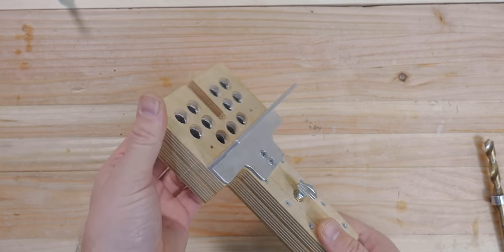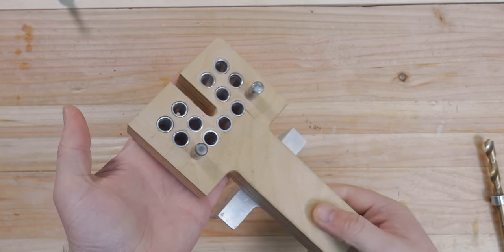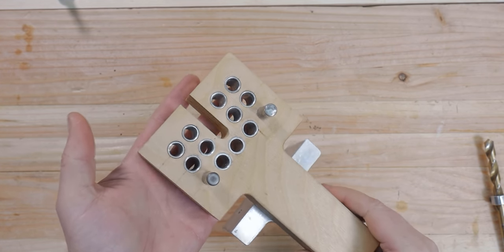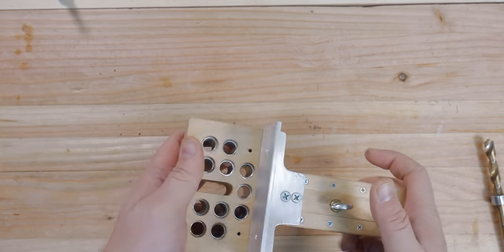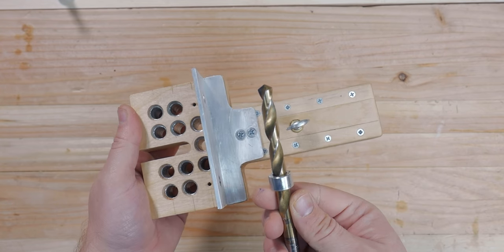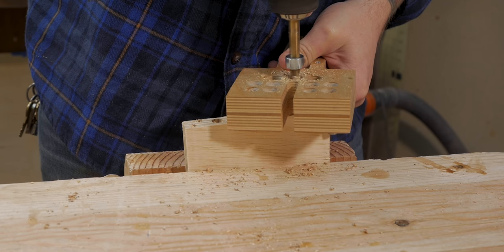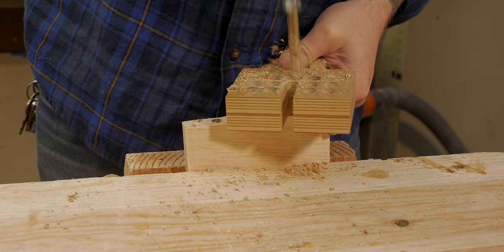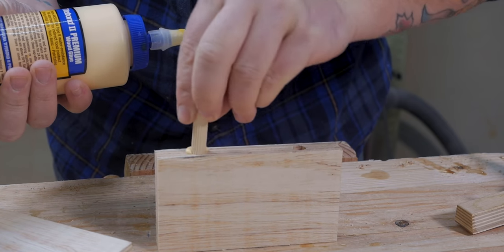Now, recently I made this little doweling jig, and if you're curious about it, there's a video available on my channel, but I think this could be a genuine contender against the dado for a few reasons, but the biggest one being, to make the joint, a dowel joint with this, all you need is a drill bit and a drill. On top of that, the joint is fast, it's easy, it aligns the workpiece, and adding a dowel to that joint makes it pretty strong.